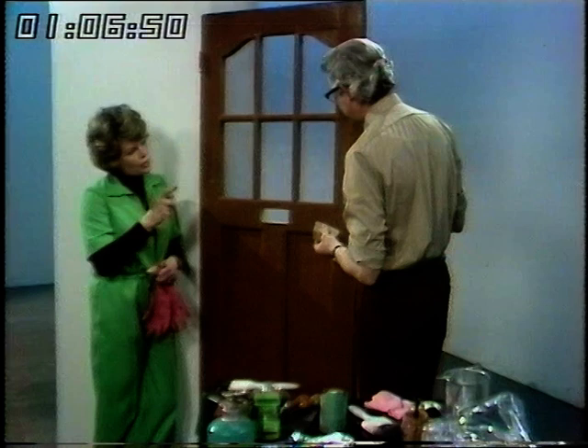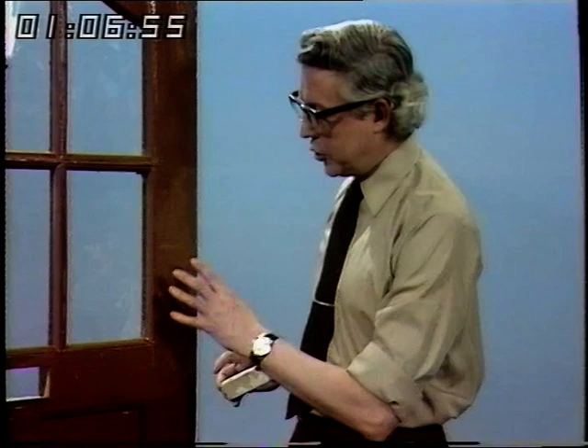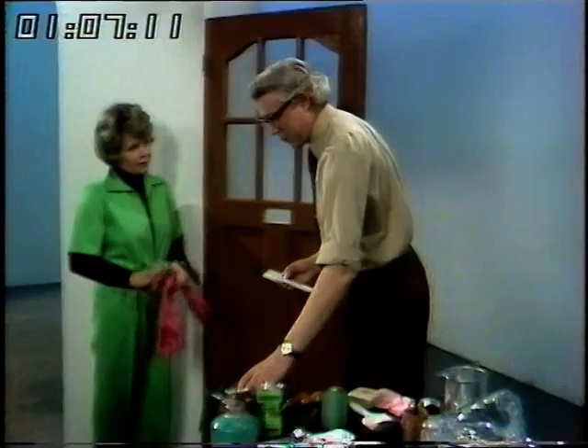What if it's even worse? Well, this is assuming that the paint's in good condition and we can just put more paint over it. But if it's blistered or coming away — rather like this bit here — then you'd have to do something different. Probably the simplest way of dealing with it is to use a paint stripper.